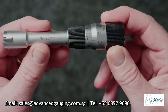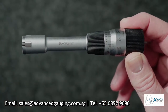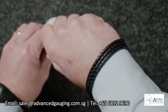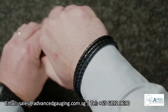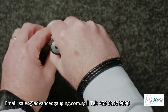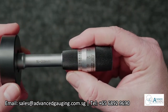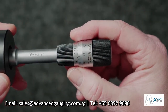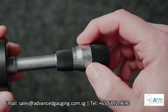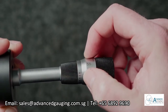To take a reading on your XTA Micro, insert the gauge into your measuring component and ratchet it up. Good practice is to have three turns of the ratchet. Once this is done, the reading can be taken utilizing the datum line, your thimble lines, and your micron vernier scale.